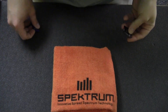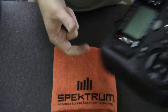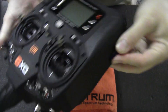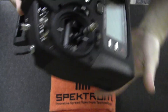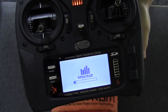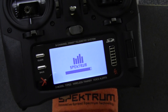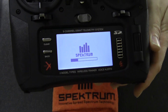We've got the firmware update on the DX9's SD card. Grab the DX9, find the SD card slot, figure out which way it goes in, and insert it. With that file named spmtx.sax on the card, when you turn on the radio you will get a loading bar that goes across the screen several times. If you turn it on and it doesn't load, try another SD card or a new file. You'll know immediately it's not working if you don't see that loading bar.